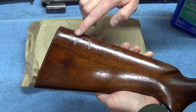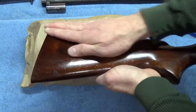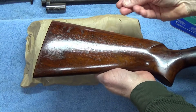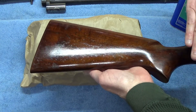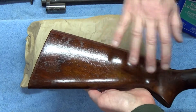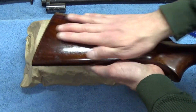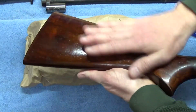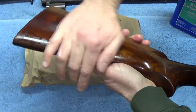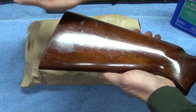Those bare spots will fill in and level up a little bit, and it'll smooth over — the finish will end up looking much nicer. Since I'm not sanding it and not refinishing it, it's never going to look perfect and glass-like, but I just want to fill it in and see how it comes out. If it soaks in really quickly because it's dry, you can go ahead and do a quick second coat right away. As long as it doesn't stay on there thick, you'll be alright — right now this is almost dry to the touch, that's how thin the coat is.